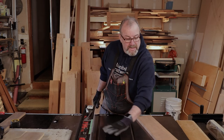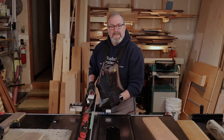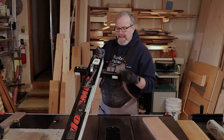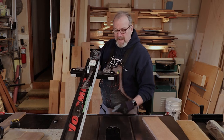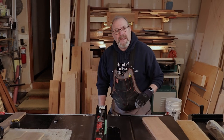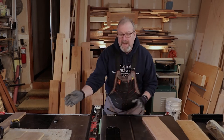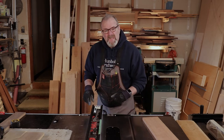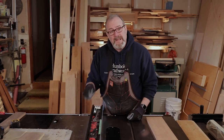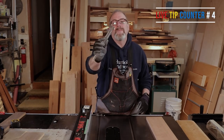You also want to make sure that everything on your tabletop is clear. And the other thing, if you put stuff on top of your fence, see this? I have a special gizmo that I do. Everything that's on my fence is Velcroed into place. If you have stuff sitting on top, like chalk and a pencil and other things, you can sometimes set it like that at a hard stop, boom, and stuff goes flying. If you're cutting something and you're coming like this, you don't want everything flying into your blade when your blade's on. So you want to keep your table saw blade from getting hit by little metal objects like that, and you want to keep yourself from getting smacked in the head, because that would just be silly. So I put Velcro on everything, even my calipers.